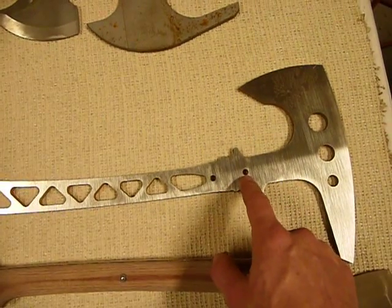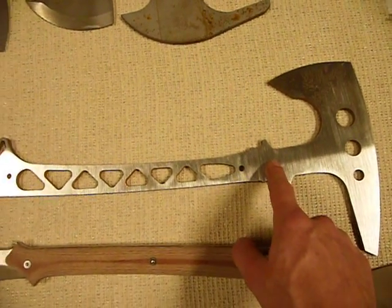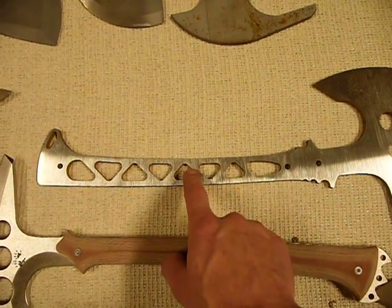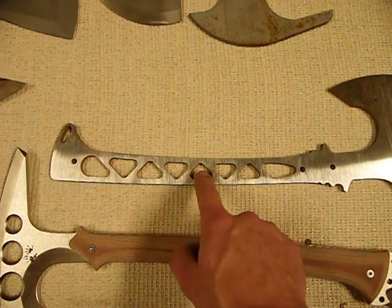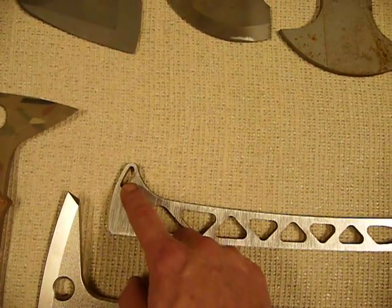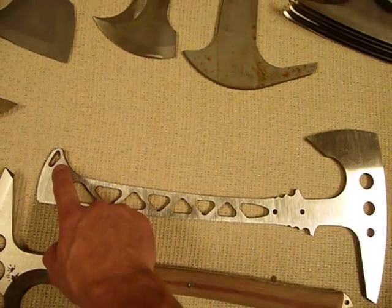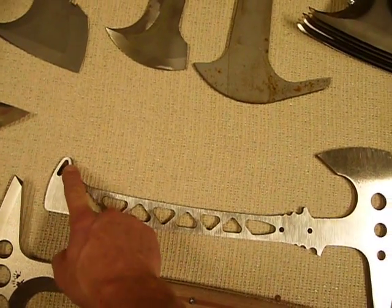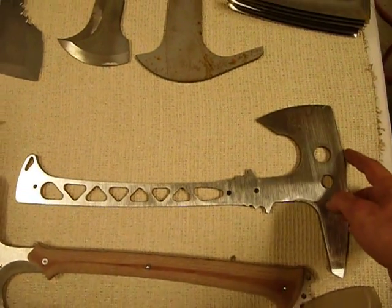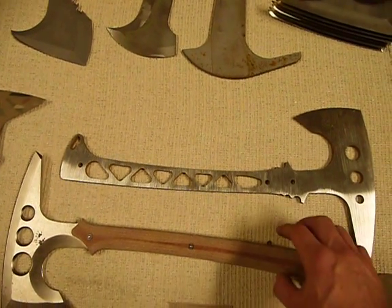Also because we have some holes in the same places, we can still bolt on the handles in these two positions, and then of course the third screw in the middle — it just wouldn't be indexing. I also put in a lanyard loop on the pommel so that you can tie a string from this lanyard loop up to a hole in the sheath. You'll be able to use your axe as a bow for your bow drill.